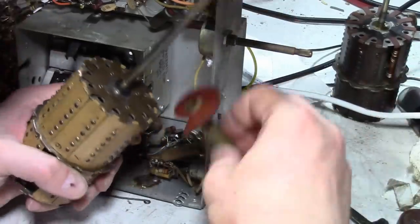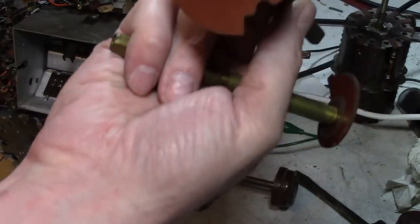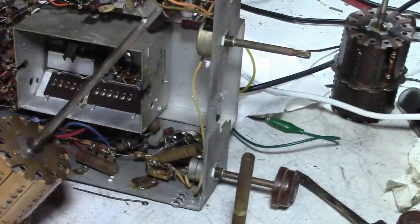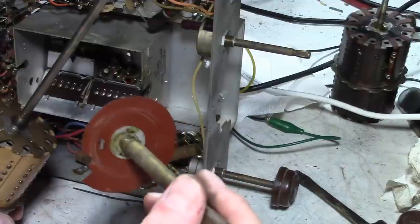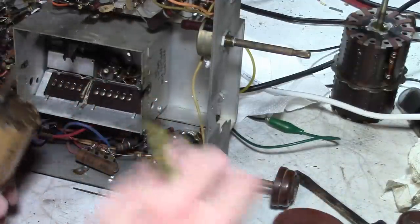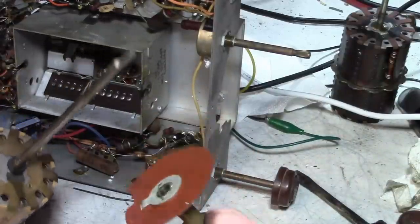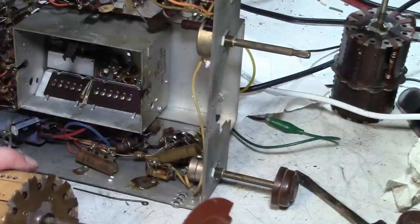There's so many little differences. So on the inside of this fine tuning shaft, there's a little wire. I'm sure that's to keep brushed against the shaft to keep that piece grounded or something. Actually, I'm not sure why that's there at all, because the variable capacitor is on the chassis. But anyways, this doesn't have it. So I can see the later design is not only more robust, it's simpler to construct and to assemble.